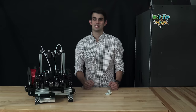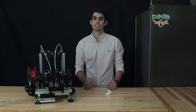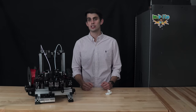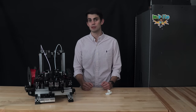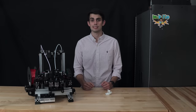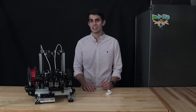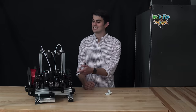There's about a million other things I could say about calibrating the settings for a 3D print, but it's best to learn through experimenting. My one recommendation is to stick with one type of 3D filament in the beginning, because as I had mentioned, filament made out of different plastics, or even from different manufacturers, will need different print settings. In the next section, we will unlock Zynex's second extruder.